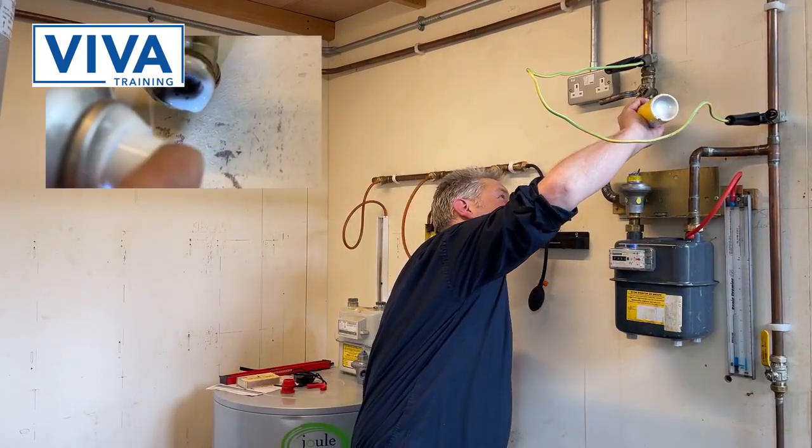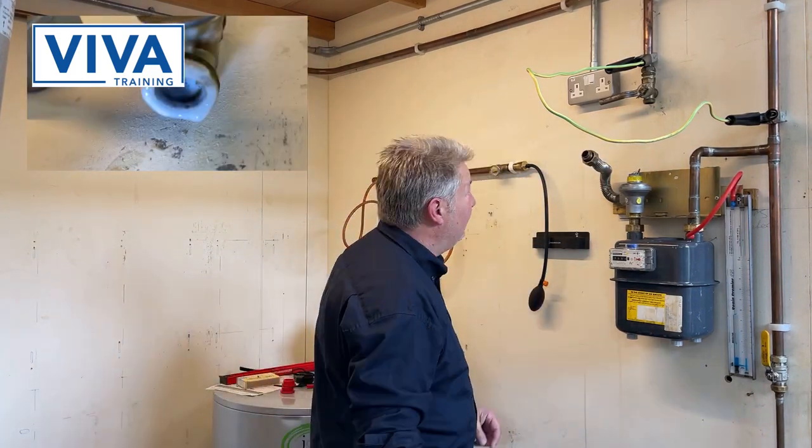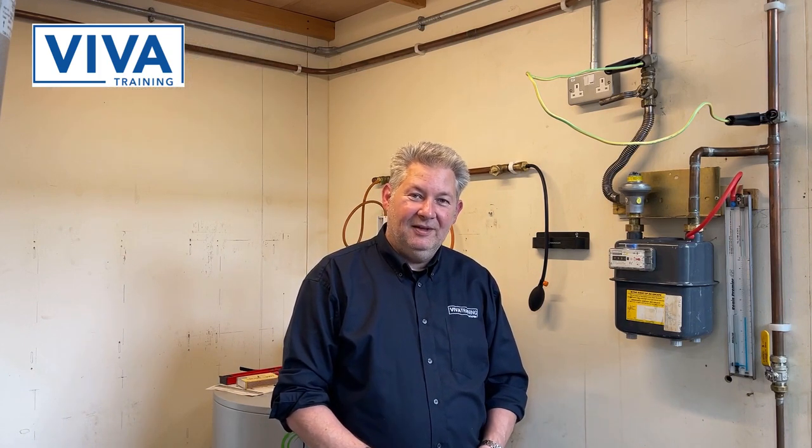I'm going to spray up inside this barrel here and take a look at it to see if we can see it bubbling. We've proved that we have got let-by — we've seen it bubbling, we've seen a pressure rise. What you don't know is there is actually a gas leak on this installation; it's been masked by the let-by. We've set this up to show our trainees how important let-by testing is. Make sure that you always do your full let-by stabilisation and tightness testing. Until next time — adios.